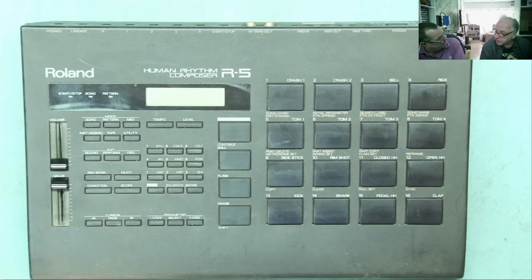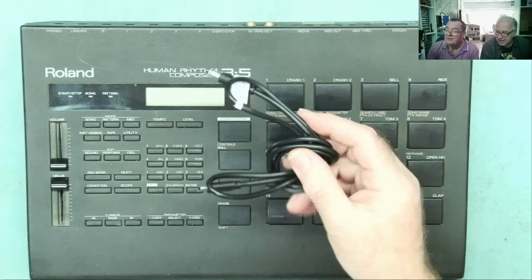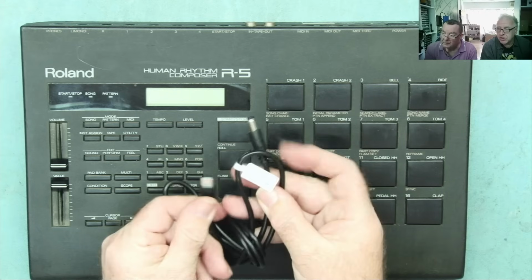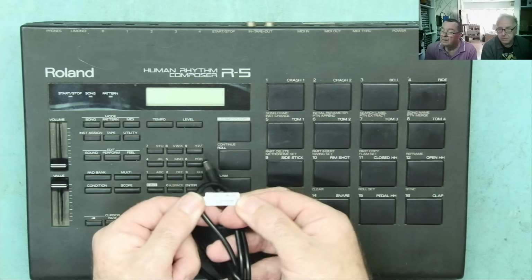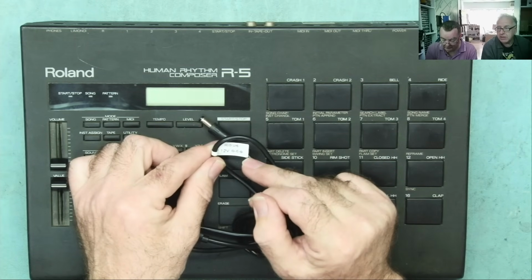What, use a 20-volt USB-C like I was using a 20-volt laptop? You could do that. You know this little cable one that's just lying over there? You might maybe want to show the people. This one. Yeah. These ones? Yeah, these are clever things. Because, there's a barrel jack, I know. But you put this into a USB-C power delivery power supply, PD. PD, yeah. Then this talks to the power supply and tells the power supply, hey, I need 12 volt, give me 12 volt. And it does.